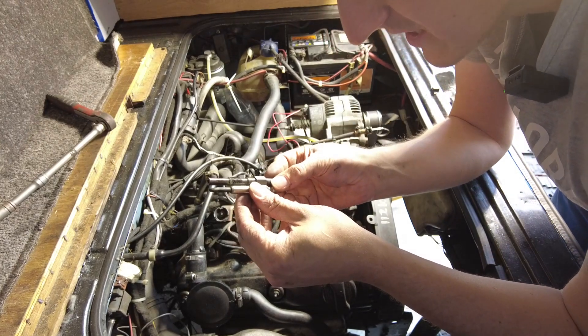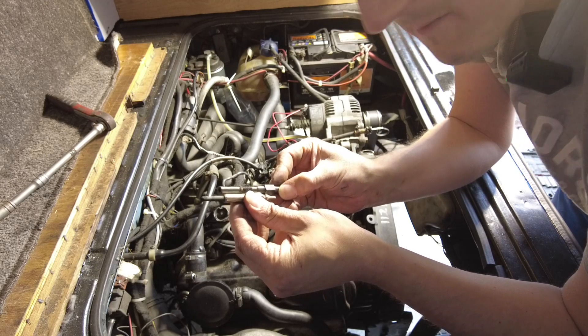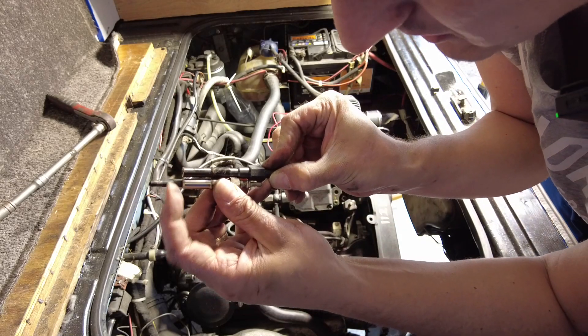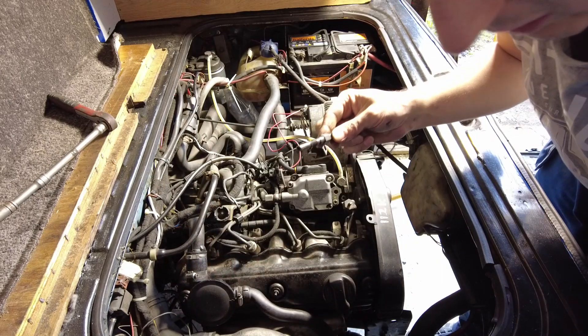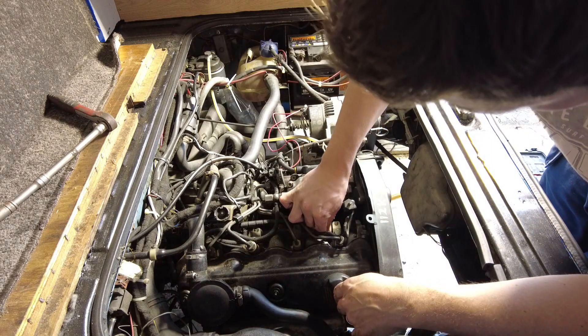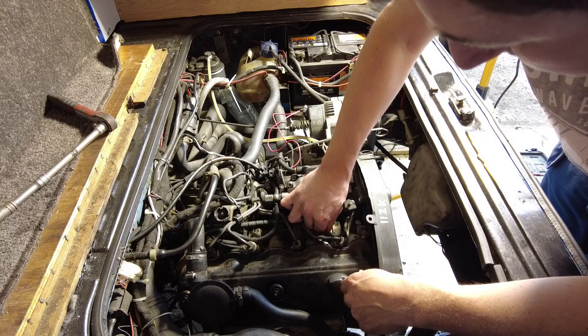So I've changed approach. The one I'm going to use is actually this one here, because if you look at the threaded area, the pipe that goes down only just goes down as far as the shoulder on the glow plug. Because if you go any further, it just binds up inside the head. So we don't want that. Let's just thread that in.